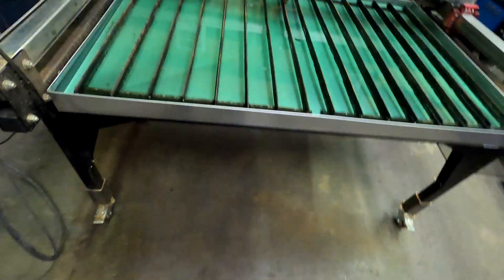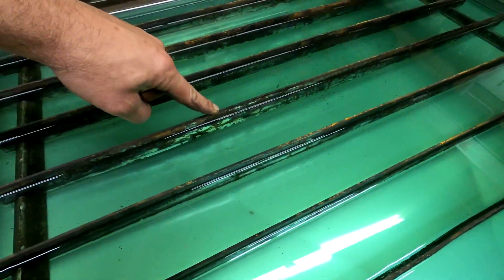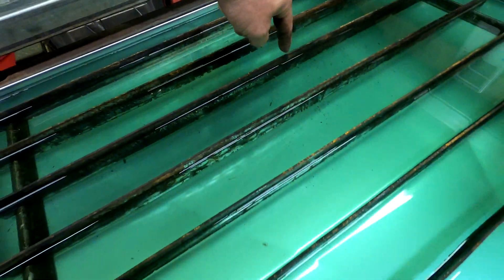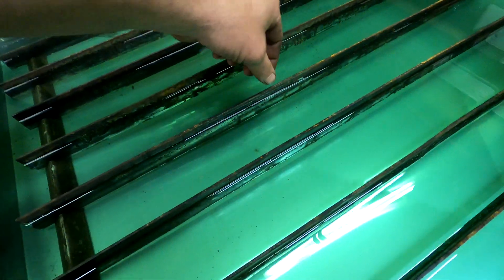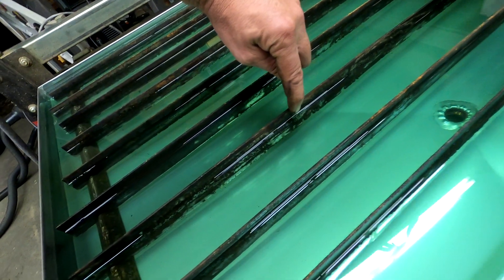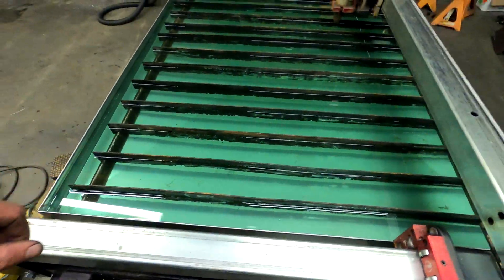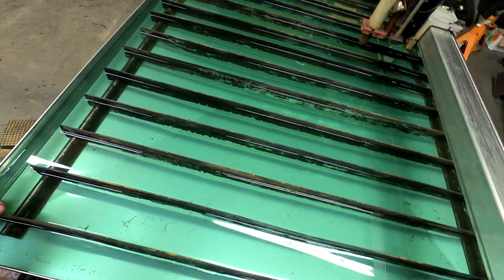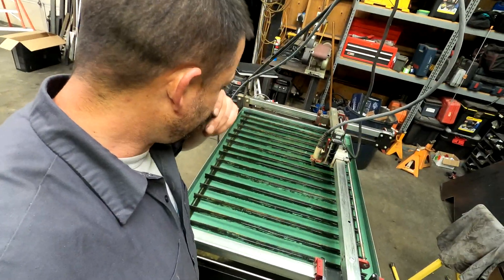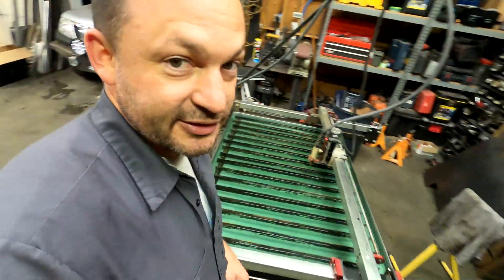It's been three or four hours since I filled the table up and we are leak-free. These slats were submerged in the fluid for about 48 hours during my two previous leak checks, and I don't see any rust forming anywhere on them. The rust on the top I just never cleaned off, but you can see where I ran the grinder — right at the surface of the water level — I have some bright metal there and there's no rust despite being submerged 48 hours. I have pretty good confidence this fluid is going to work. We'll come back in about a week or two and check for rust or any other corrosion, but it looks like our CNC table is back in business.